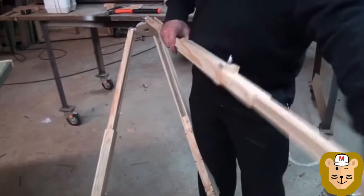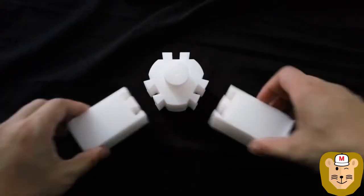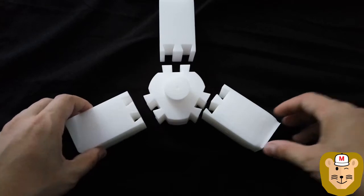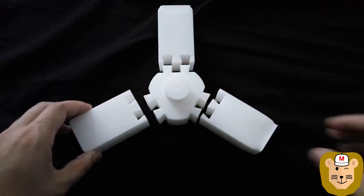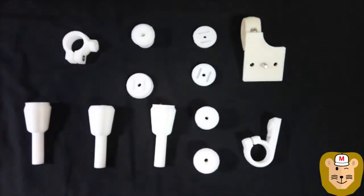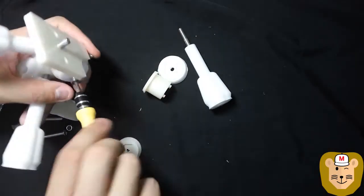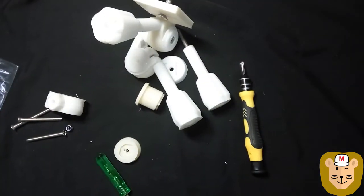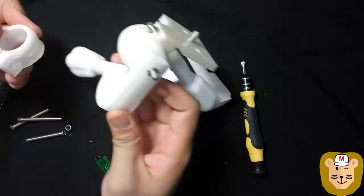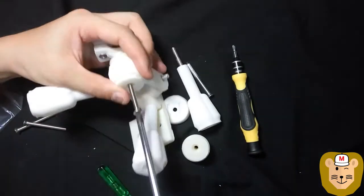Paulo Queros's design was made purely out of wood, but since I didn't want to get more wood, I designed and 3D printed a centerpiece for the tripod. The full model was bigger than what my printer could do in one shot, so I created dovetail joints between the arms and the centerpieces. I also found a tripod head mount design online and printed that out as well. It was really simple to put the whole thing together with just some nuts and bolts, and the movement in all directions is really smooth. You can find all the files in the links in this video, and all the pieces took about 30 hours to print in total.